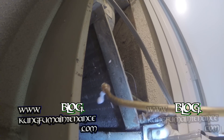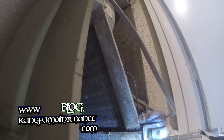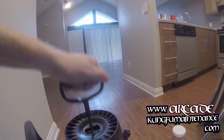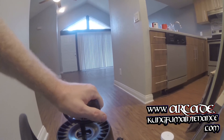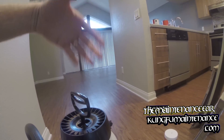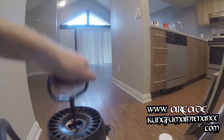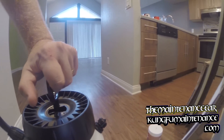You know about soap — the way soap works is it's hydrophobic. That means it's afraid of water and it tries to get away from the water. The way it does that is by digging under the dirt. So it acts as a catalyst to release the dirt, and then the water can help carry it away. That's why the no-rinse coil cleaner can work.